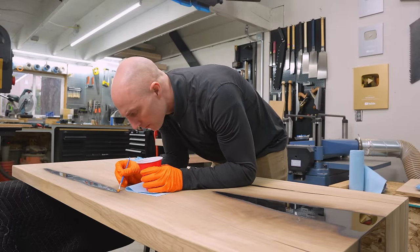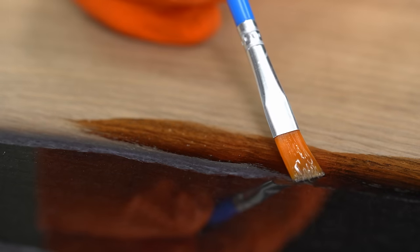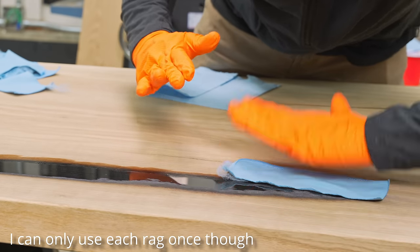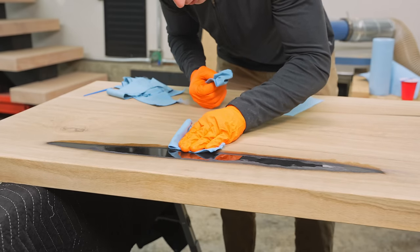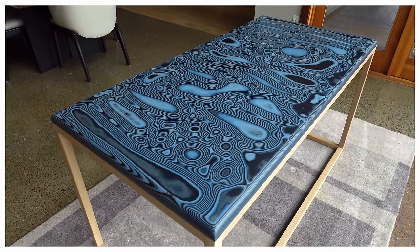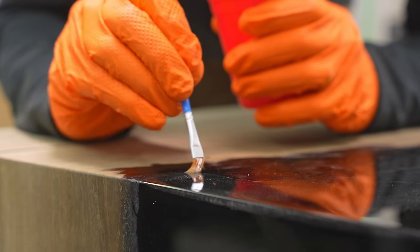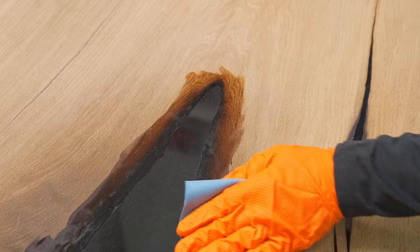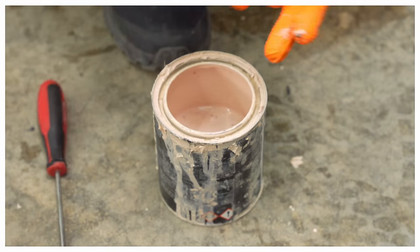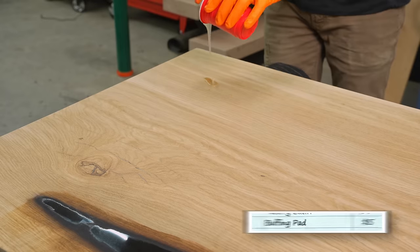The oil I'm using is kind of matte to satin, so I don't want to get any on the polished epoxy — if I get a tiny bit I can wipe it off with alcohol on a microfiber. I'm using a little paintbrush to get right up to the edge and cut microfiber towels, pulling away so I don't drag the oil onto the epoxy. I tried invisible oil — which I used on a white oak table recently and it looked fantastic — but it has white pigments that just got embedded in the black char and looked terrible. So that's why I didn't use it.